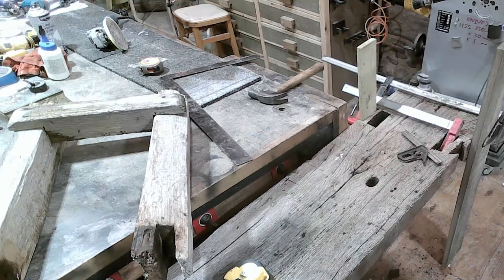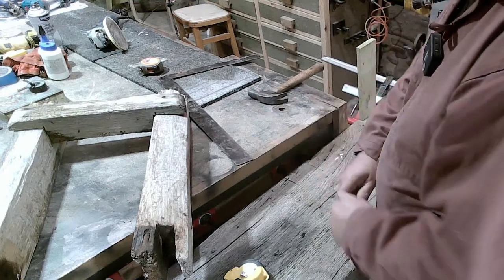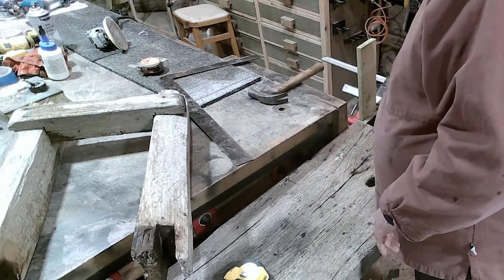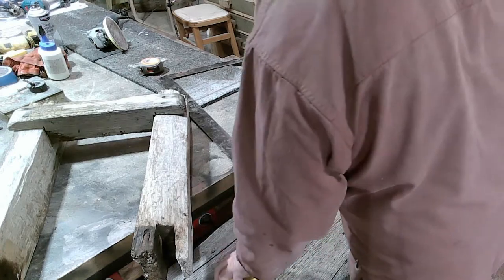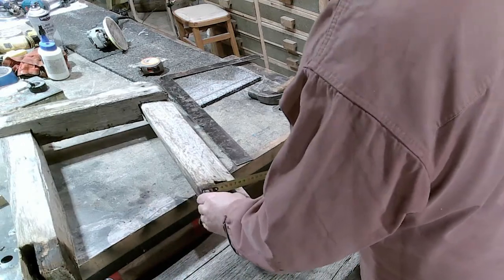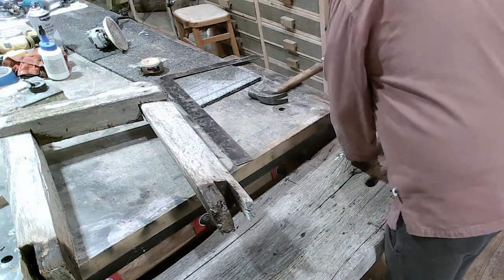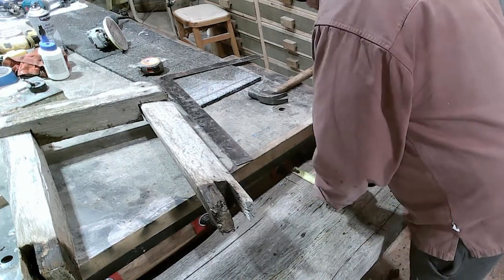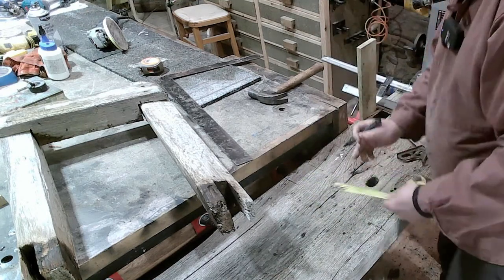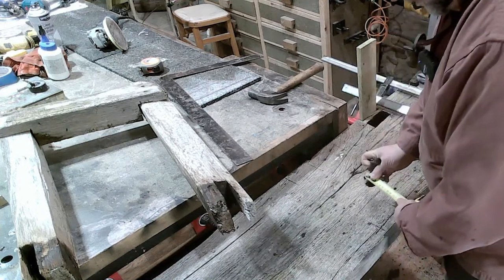Now that's about what? 70, 80 mil thick, that top is. There's quite a bit of chalk there. It might look, yeah, those bits I showed you a bit kind of rotten. But it's actually hard old bit of oak. So it's gonna be fun chopping through it, that I must say. We said 35 mil, didn't we? So that's 35 mil. So I'll go from the back edge, which is 85 millimeters in. Yeah, we said on both. 85, let's go 85.